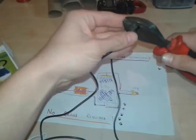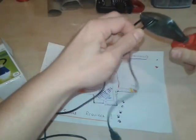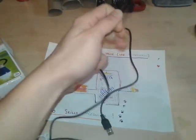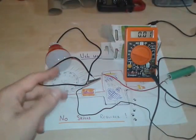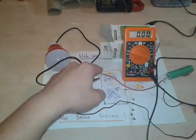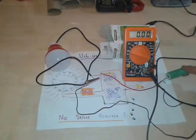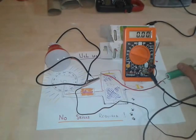Now we're gonna cut the cord, just like so. And we're gonna connect it to a battery. I just stripped the wire of the LED and connected the multimeter in series with a rechargeable battery to see how many milliamps this light bulb consumes.